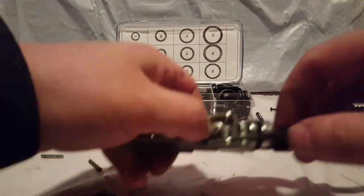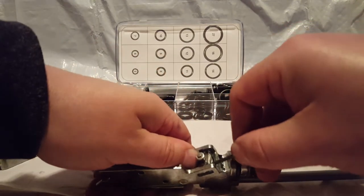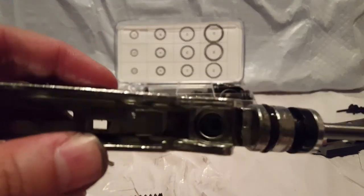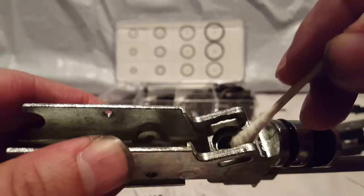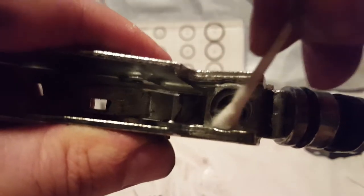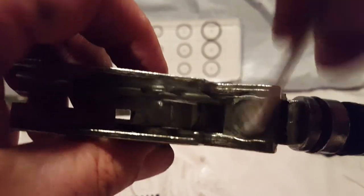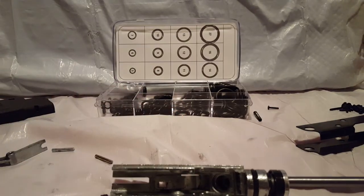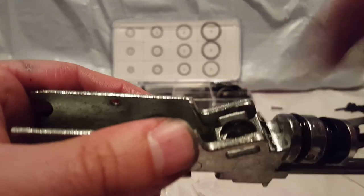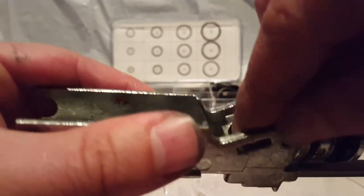As far as your valve assembly — I do want to make sure you get that name right. I call this a chamber seal because it does help seal in air, but it's a valve assembly. When you clean this out with a Q-tip, you don't just get in here and do the inside. There is a rim — that's where the O-ring goes — and he wants that cleaned. Get in there and get those edges, get around in there and get that edge right there where the O-ring goes. He wants that clean so that when you get your number 7 O-ring out of your kit and put it on here, that ridge is clean — and he means clean until it's white, because you don't know what type of oil they used. So we just put that in there.